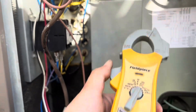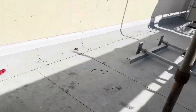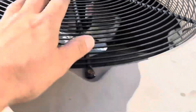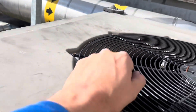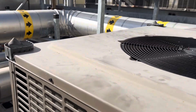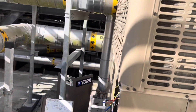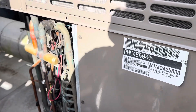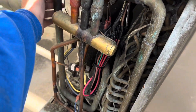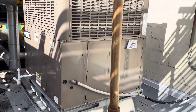This shouldn't be pulling anything because this is for our electric heat. Let's take a look at our fan. I did my best to tape up the wire going through here — it's not perfect. I might order the conduit that goes through there, because when the last technician replaced that motor he must have got rid of or broke the conduit, and I don't like it pressing up against that hole. We'll watch this for a few minutes but I think we're good. Suction line is good and cold, safeties say we're okay, and there it is — back operational.